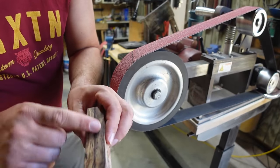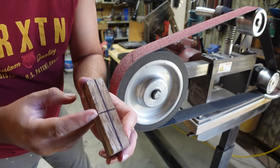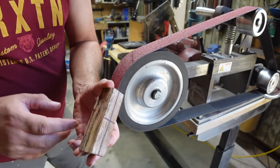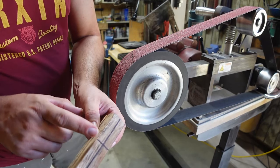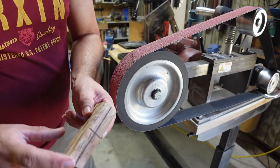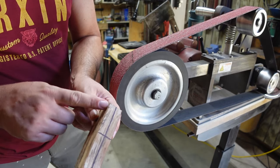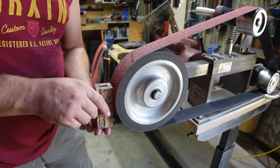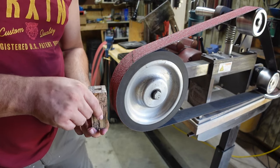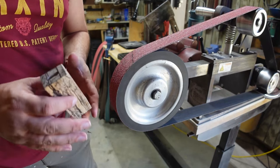So we've got our lines, and then on the bottom, where your fingers are gonna go over, I've got another line marked right here. So there's gonna be a little swell on the finger side. It's gonna be smooth on the back side. So basically, it's just gonna have a little facet that comes through here, and we're gonna be creating that whenever we start rounding. It's gonna be subtle, it's not gonna be too crazy. It's just gonna be enough to stand out.